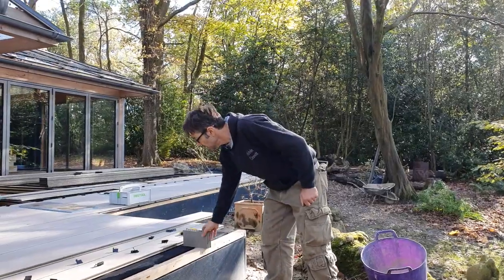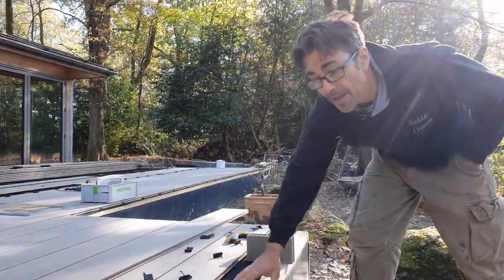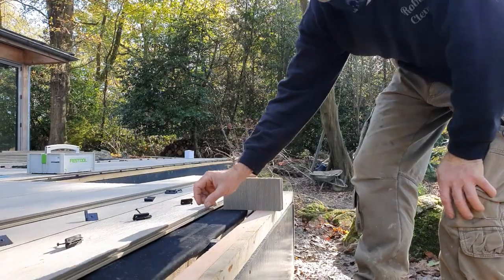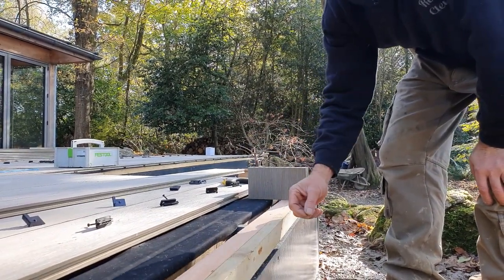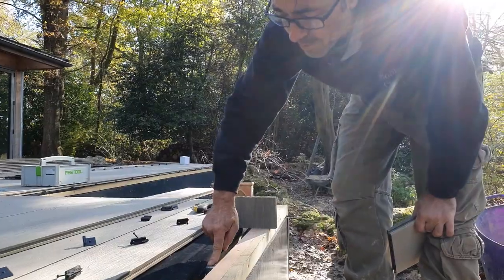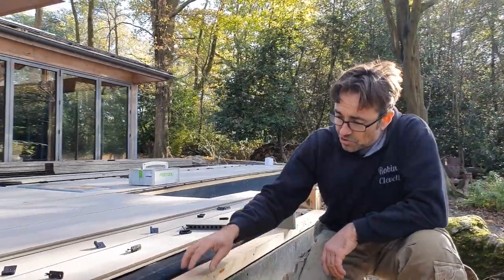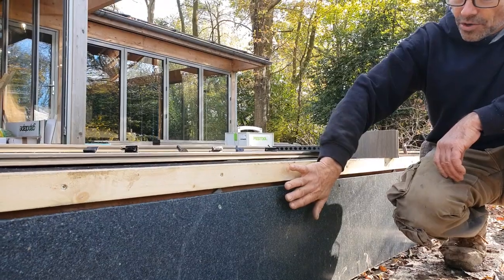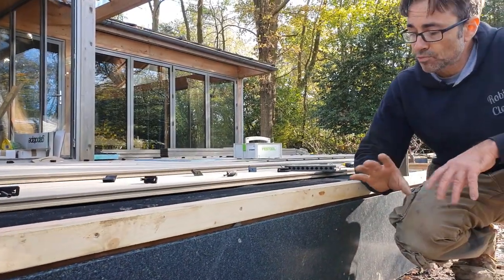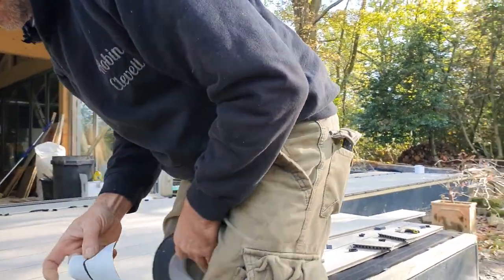The other thing I did here is I made my deck structure to where I knew it would be within a full board, then afterwards I finished the exact measurement once I had that board in — because if you try to do this before it's not an exact science, you are going to gain and lose and you wouldn't be where you wanted to be. I've got plastic plywood shims and a plastic plywood fascia which runs all the way around. There's a gap and it's packed off the structure so air can circulate, and our new fascia which goes over the front is also on spacers to allow the air through and make sure everything is properly ventilated.